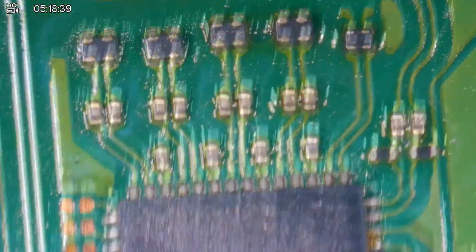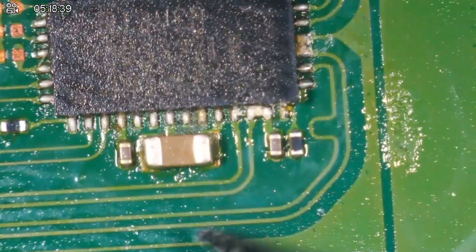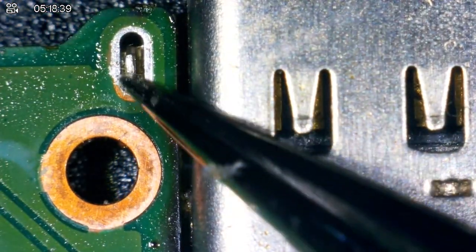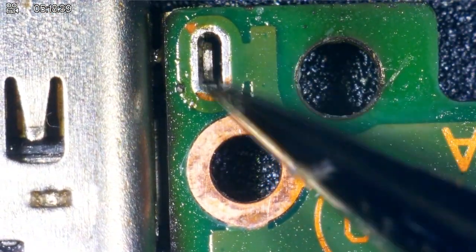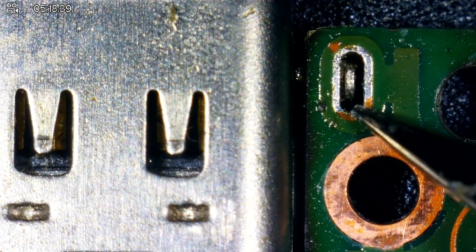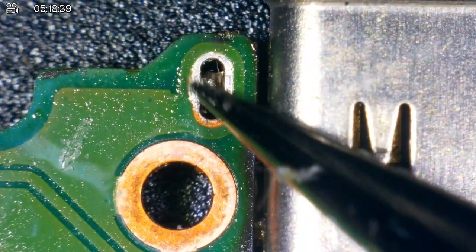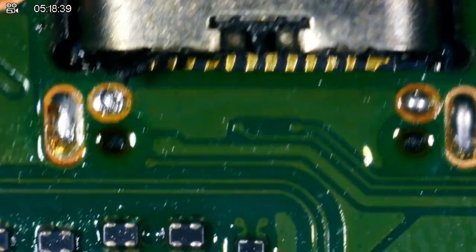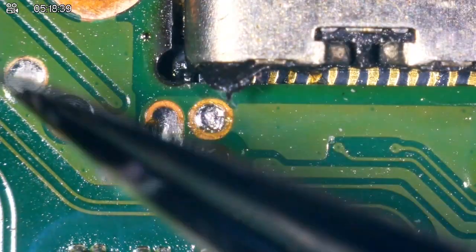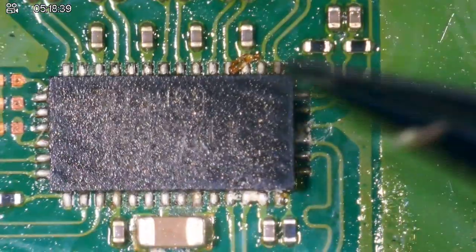Let me show you the real beauty of the board — turning over to the back where P13 resides. They have also replaced this chip. There's flux everywhere on this board around the filters. Look around the port — there is no solder here and no solder here at all, not even a tiny bit, whereas we have solder here and here. My first thought is: what if the charging port needs to be soldered to these ground legs for it to actually work and deliver to the M92 chip on the other side of the board? We also have a bubble on the board. These are the times where you'd need an ultrasonic cleaner, which I don't have. I'm going to grab some isopropyl alcohol — IPA — and a toothbrush and give this whole board a quick clean.